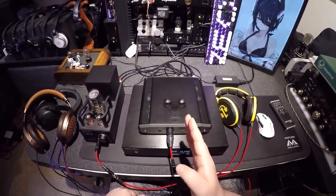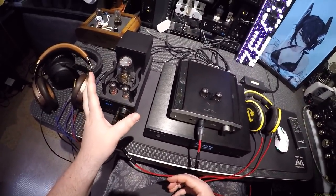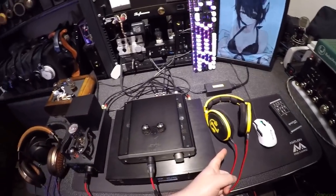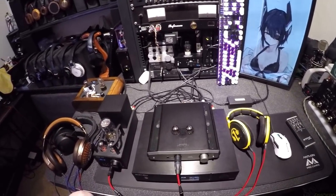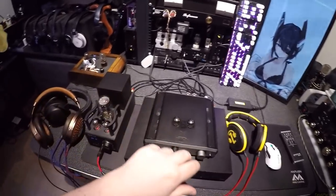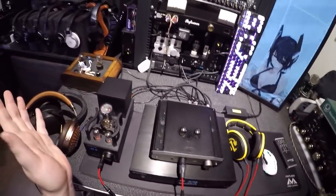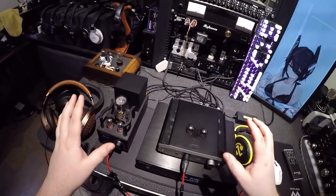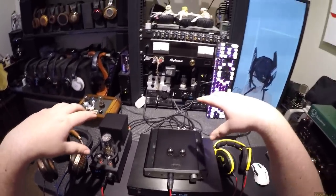But if you are hunting down an actual hybrid amplifier that will take tubes and give you the power, one of the problems with the Roger here is it's not very powerful. I run 600s on it, and it is only single-ended. You gotta max that thing out. So you're sort of at the mercy of whatever tubes it's using and your source volume. And if you get distortion, it's because you're maxing it out. That's what the Dark Voice and that are, real tubes. They have real tube benefits and real tube problems. Those things come hand in hand.